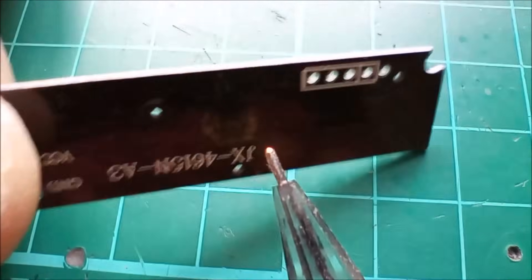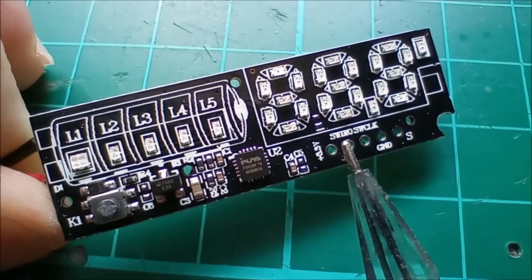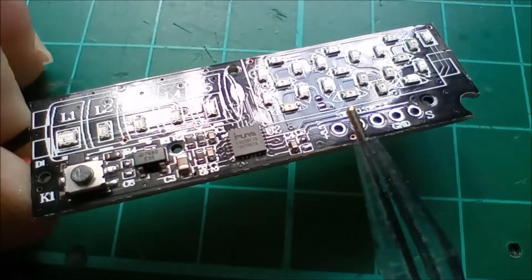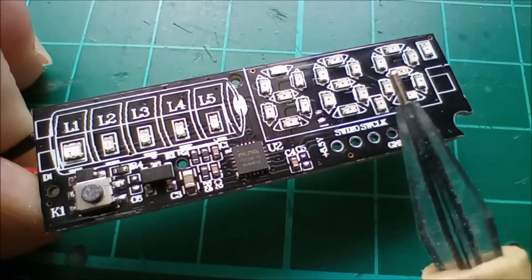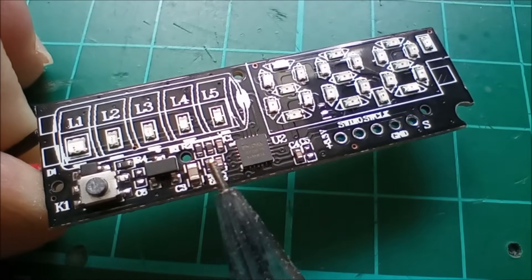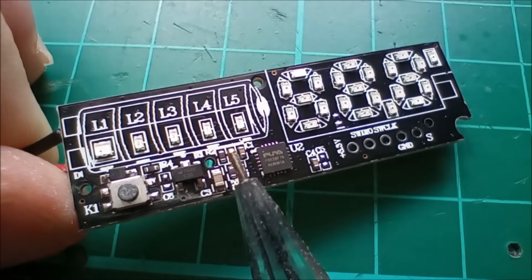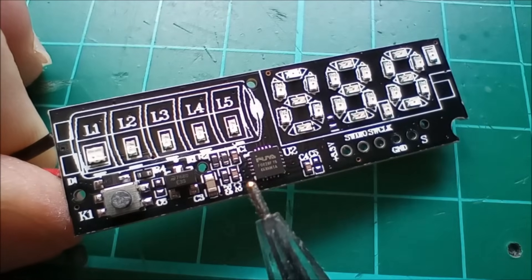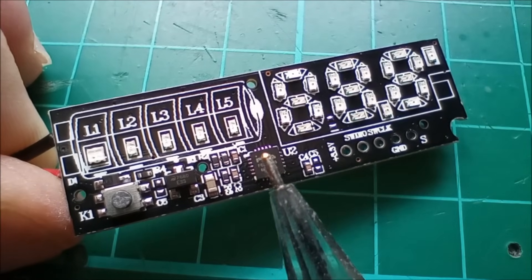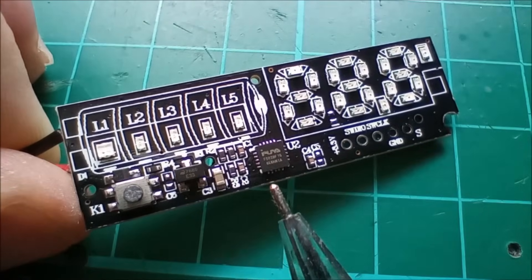What it seems to be is an anti-reverse-polarity diode, a resistor, a switch. I can't see any resistors for these LEDs actually — that's interesting, maybe they're all multiplexed onto one resistor. But you can see the digit eight LEDs, the decimal point LED, the V-for-volts LED, the programming connector — oh, it says plus 3.3 volts. So I guess this is a 3.3 volt regulator, a big capacitor, some small capacitors and resistors, and a microcontroller. That's really it. I can't see any resistors for current limiting of the LEDs — so maybe there's just one resistor and everything else is multiplexed. The chip itself only has five pins on four sides — that's 20 pins.